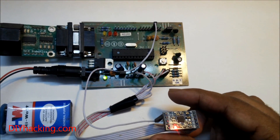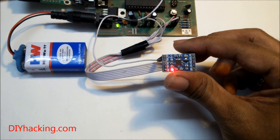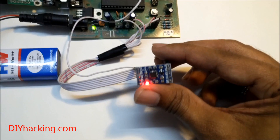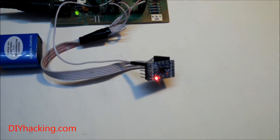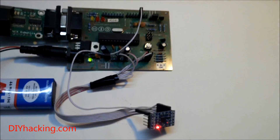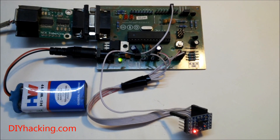The interface and interconnections between the Arduino and the MPU6050 are really simple. It uses the I2C communication protocol. You just need to hook up the VCC and ground of the sensor, the SDA and SCL pins to the Arduino's analog pins 4 and 5, and also connect the interrupt pin of the sensor to the Arduino's digital pin 2.